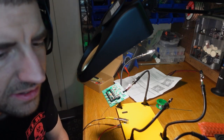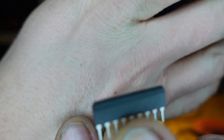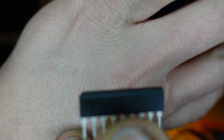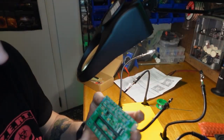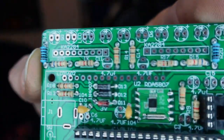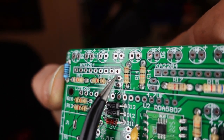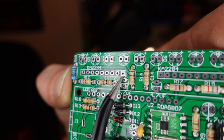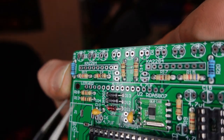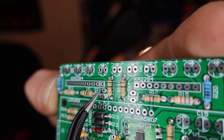Okay, that is what I thought. Alright, so with the LED drivers, that's these chips here. If you can see at the end there, where one end looks like it's been cut off at a 45, according to the illustration in the instruction manual, that is to match with a little square at the end of each of these slots. Okay, and there it has to be that direction. I thought that was anyway because the instruction does say that you have to verify its direction, but the pictures that they have in the manual do specifically say that that cut goes to the square on the board.